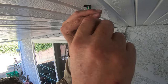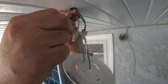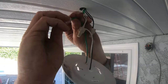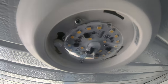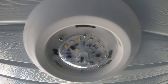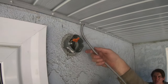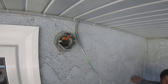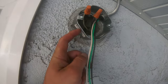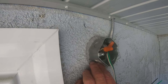Once we have all the wires twisted together, we're just going to stuff all the wires right up into that hole. That white little plate you see dangling is actually going to be the connecting plate to the lights — they just lock right into it, it's a twist-on lock. Here is the main power feed where we connected everything to — it was the old lantern light they had out here. We don't need it anymore now that we have the recessed lighting in the patio cover, so we're just going to tap right into this power feed right here. Once we do that, we're going to close it off and we're going to have lighting for the backyard.